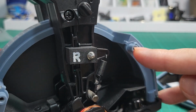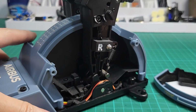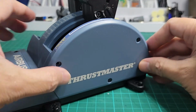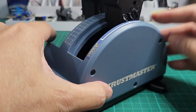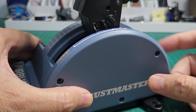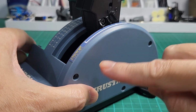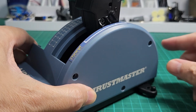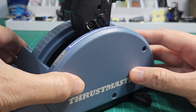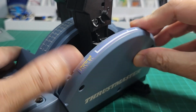And that means with plastic thread, any over-enthusiastic tightening could easily break these threads, and then you lose the hold of the screws. And let's remember that this whole mod relies mainly on the tension between the BallPoint screws and the plates seated on these covers. So it is very important that these screws maintain the hold against the tension. If you break the threads of these screws, that means it's the end for the mod.